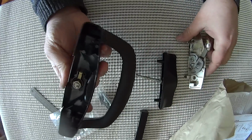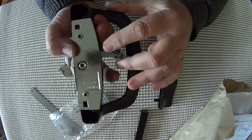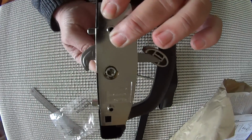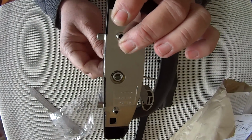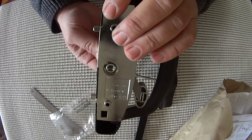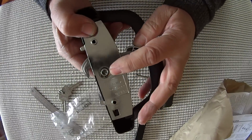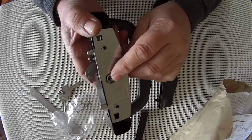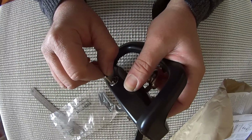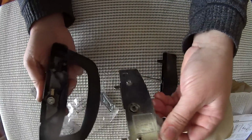Okay, once that's secured in that position, this little triangle section right here, you activate the lock with the key now. Locked, unlocked. Now when I'm using the key, it's different to just flicking it. If I flick it, I can flick it down. If I use the key and take the key out, this is deadlocked. And that's a very important factor. So by installing that cylinder with that step down, this won't move around and the lock is installed properly, giving you maximum strength and maximum protection.